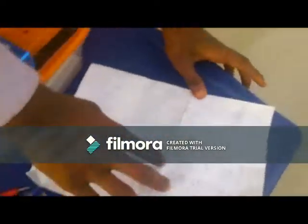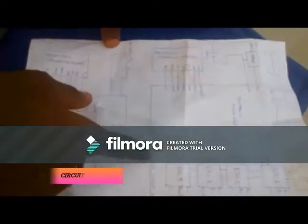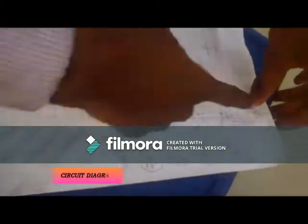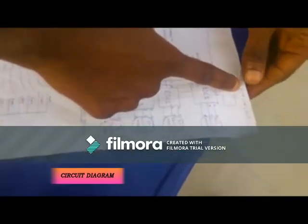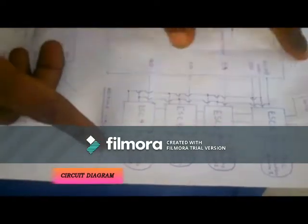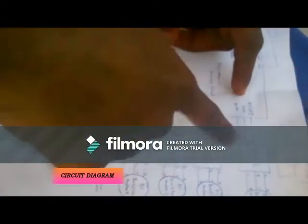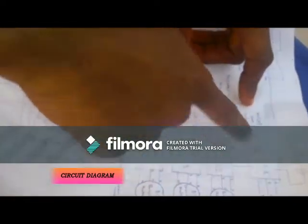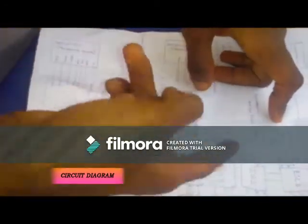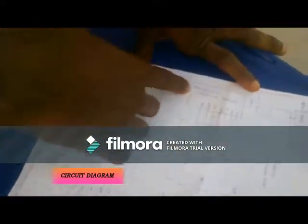This is our circuit diagram — specifically the receiver circuit diagram, the one on the drone. We have ESC1, ESC2, ESC3, ESC4, and we have the switch and our battery pack which is 4 series, 2 parallel. We have our brushless motors connected this way. Each ESC power connection is joined together — VCC and ground. The pulse pin of each ESC is connected to digital pins 17, 16, 15, and 14. We also have the NRF module transceiver.